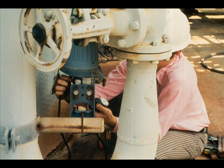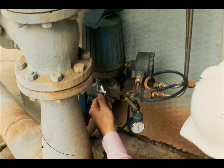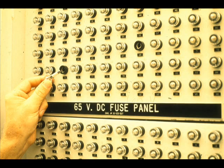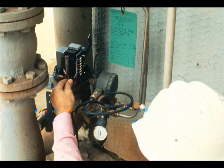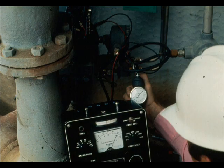Depressurize the cell body by opening and closing the low and high side vents or valves. Connect a suitable calibrator to the high side of the transmitter and open the low side vent. Remove the DC power from the transmitter loop. Disconnect the transmitter red and gray leads at the meter. Connect the 8121 current calibrator and calibrate the transmitter for 0 to 100 inches using similar procedures as were used in the shop.